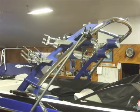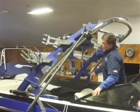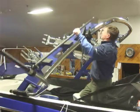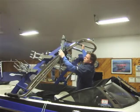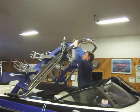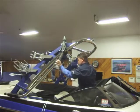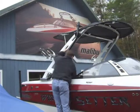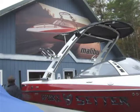It's probably easier to see in the original prototype video that we did on the water. But tipping your boom up and down or removing it is best done from inside the boat. Simply unclip the cables, pull the upper pin, and pull the boom up to store. I did not have enough room in the shop to do it with the outer section in, so I took the outer section out. But even with the bimini, it actually works better with the bimini on because the support rod can just lay on top of the bimini while you do this. You can simply tip it up, remove the outer section, and put the pin in. If you do want to remove it at any point, you can simply pull the pin, slide the boom out, and take it right off the boat.